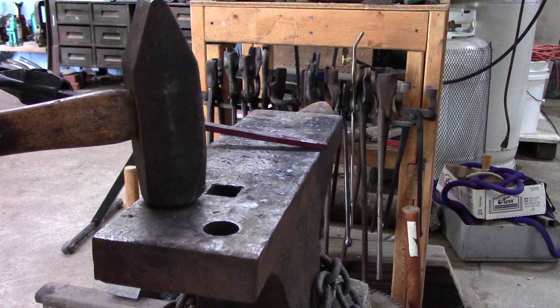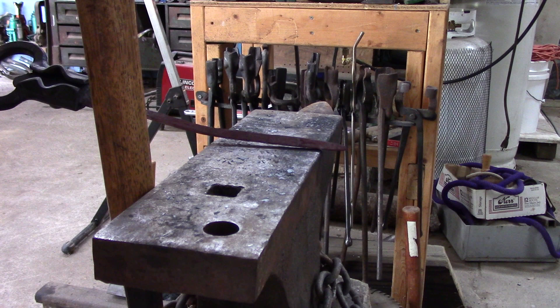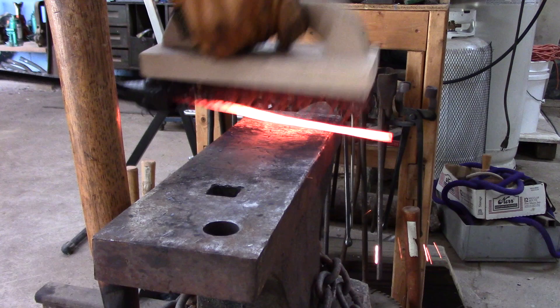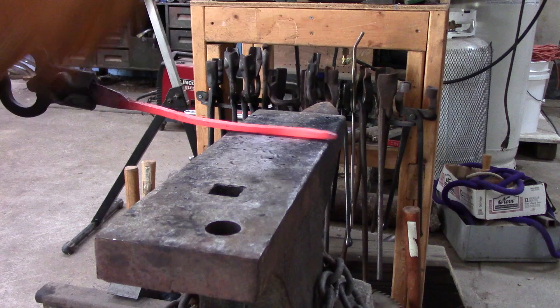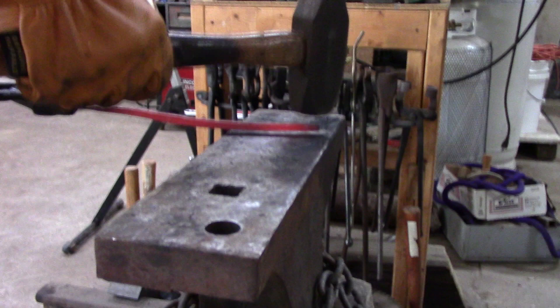This is just evening it all up, leaving it as a rounded flat sort of shape instead of the straight square that it was. As I get closer to the final shape, I want to be sure to brush it — that gets the excess scale off so you're not forging the scale into it. I don't want it to be particularly finished. I want it to look like a rough, frontier-made knife, so I don't want a real perfect smooth forged finish — which I'm not sure I'm good enough to achieve anyway.